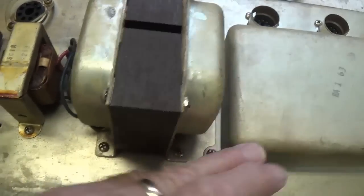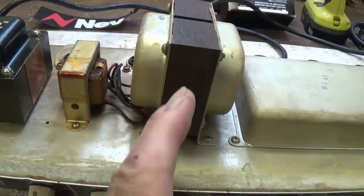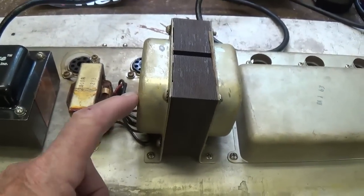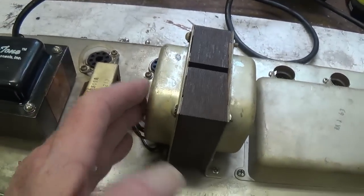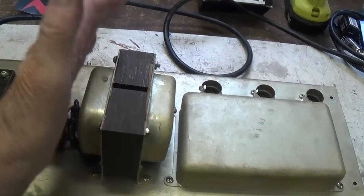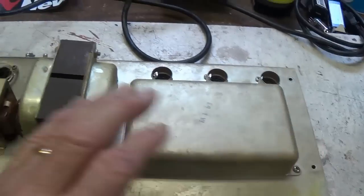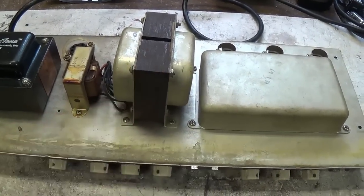That's about it here on the top end. We'll open the doghouse in just a minute. We see that it's kind of typical. You see that the output transformer is tilted because the box was dropped on its end at some time or other, and therefore the momentum of the transformer and the mass of it caused it to continue after the bottom stopped, and bend. Okay, I'm going to straighten that out. I don't like the looks of it.